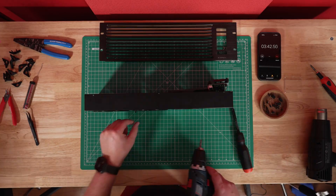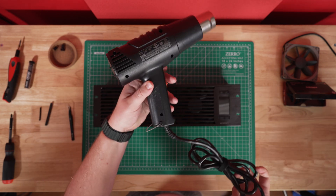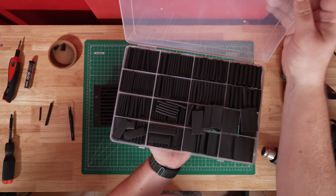This upgrade took me just over an hour, and yes, soldering is involved. You can find fans with smaller three-pin headers and you might avoid soldering, but in my case I had to connect the Noctua fan to the stock cable with the smaller connector. As for price, assuming you already have the tools — soldering iron, heat gun, heat shrink or electrical tape — you're looking at around $55 per Cloud Plate for the three-fan version. I think that's not bad value since you've already spent $140 on the Cloud Plate itself, and given the performance and noise reduction you get, the $55 is worth it.